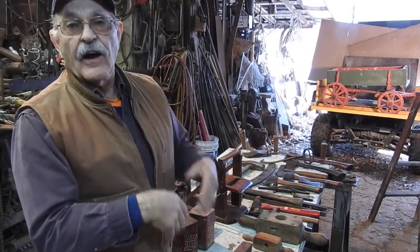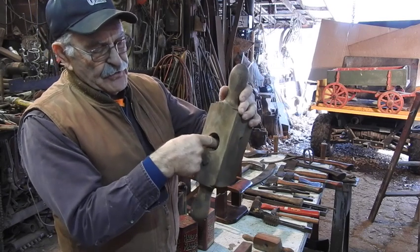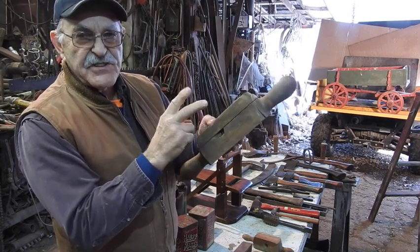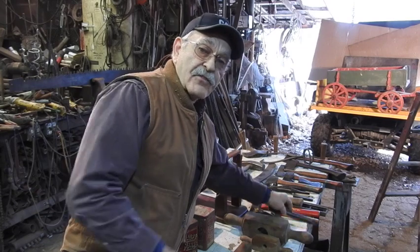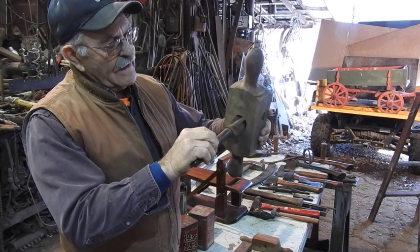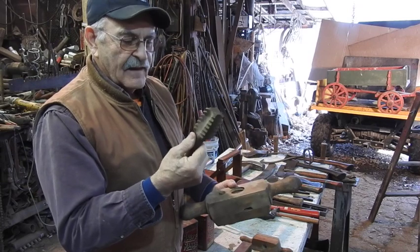These came from our great-grandfathers on our grandmother's side. Here's the much larger size — you can see where the bits are driven right through these and adjusted to cut the shavings off your wood to create threads. I think this one's set up for two cutters, even though there's only one there. This cutter is actually V-shaped, so some of the shavings might come right out this hole. You also have to have the female portion — here's your tap and here's your die. That's pretty unique because in all the junk I've seen, I've not seen one of these before today.